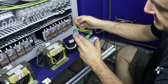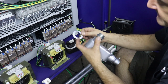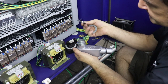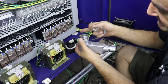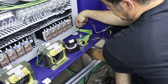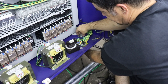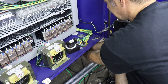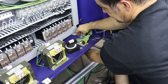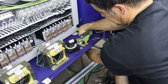Basically what you do is you stick, so this washer has a pressed-in flange, and that allows the flange to basically lock within the inner circle of the cabinet, which is oversized for our 1-inch LB box. So you put the flange up against the screw crown nut, which is adjustable in height, like that. And then you put the LB box through. This washer actually isn't quite the right size, but the idea is that the second flange locks the two washers into that hole, and then you can lock down the top with your second nut, making sure you've got enough room for your safety plastic cap that I need to buy. Anyhow, so this is how you can adapt a hole with these stepped washers.